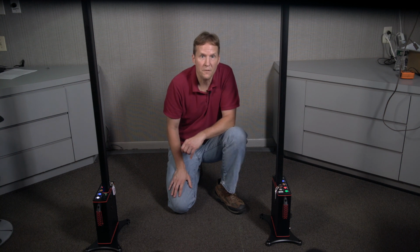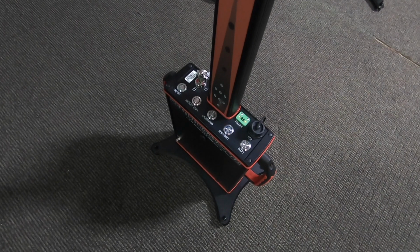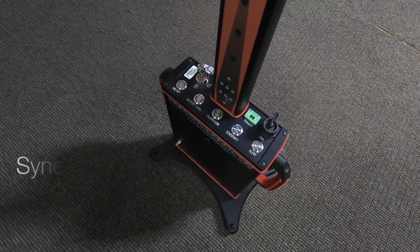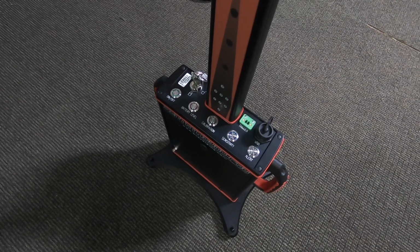This approach allows for much more foot traffic to flow through, but does not isolate the detection to a single person. When detection does occur, another scan will need to be performed to identify the person responsible. Both IR sensors must face each other. Turn on both poles within 4 seconds of each other.